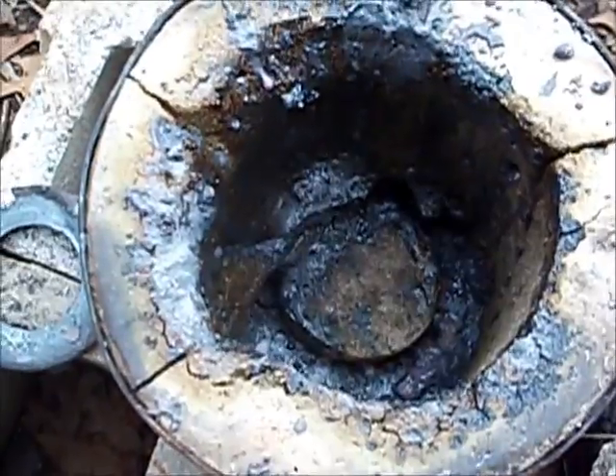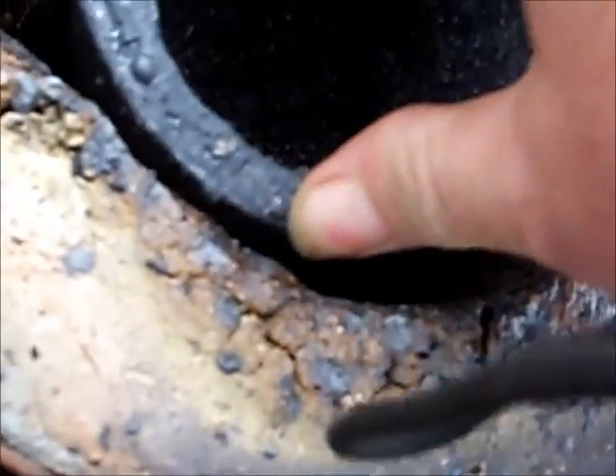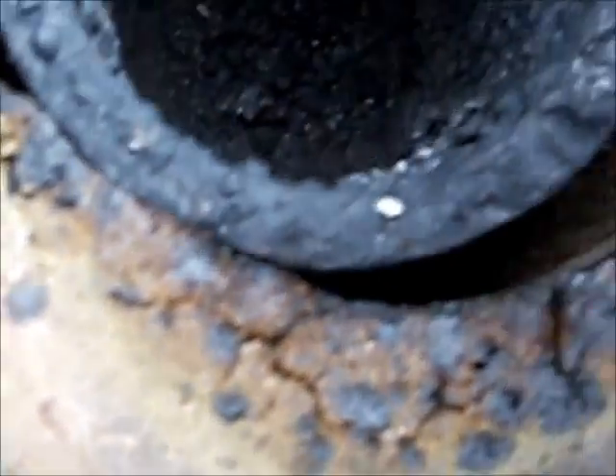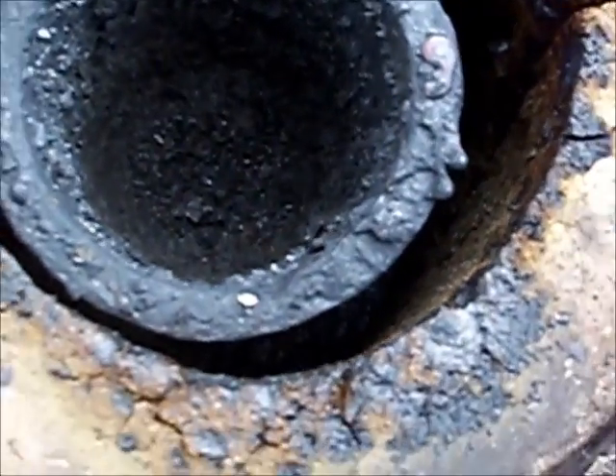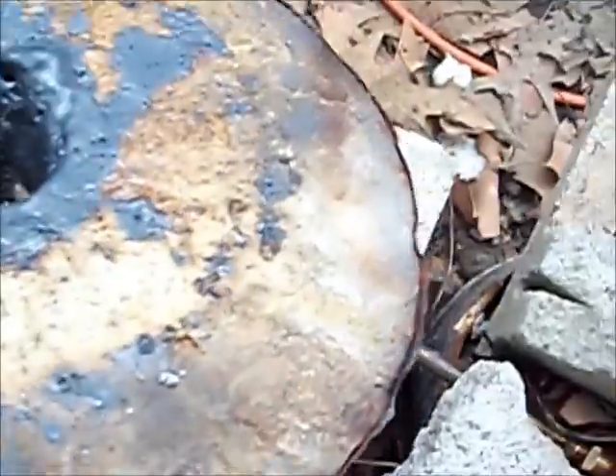This mix was two parts fire clay and one part Portland cement and it just melts — it drips off, drips down the sides, and puddles up. All that slag came out of the last pour I made. The metal slag came out of the last pour; it doesn't even sit solid anymore because it melted the plinth partway. And that's the top off of it.